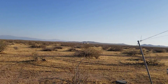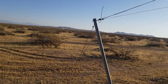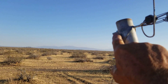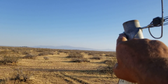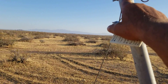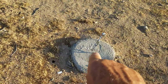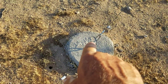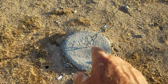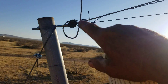I talked about the spring poles — this is what I call a spring pole — and you put these on your guy wires. You could put an adjustment here, which I did, which is an eye bolt going through the pole so you can tighten it up as your cable stretches a little. Then you also have this cable going down to a footing with an eye bolt in it, and you put a turnbuckle in there. So you can see that's expanded all the way, meaning I can actually tighten that up, which will pull on this pole and tighten my guy wire.